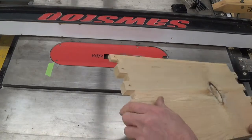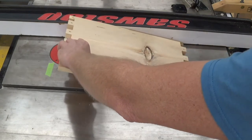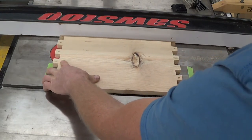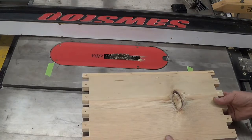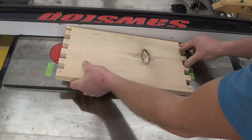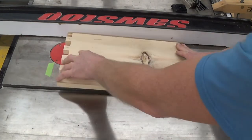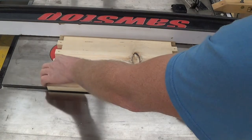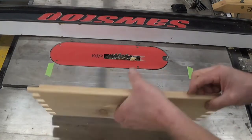The trick here is really important: be confident in what you're doing and have a firm grip — it could get away from you and cause an accident. I'm going to fire up the table saw and very carefully break this against here, keeping this firmly on the table at my mark, and make a plunge cut. Run the plunge cut until I get to the tape, then lift it. Now I have a handhold. You hold the board firmly against the fence, hold this end against the table so it can't pivot, then plunge into the saw and go until the other end is on the tape. Then lift off this side — you'll rotate through and end up with a nice little handhold for the box.